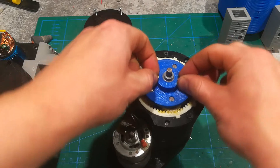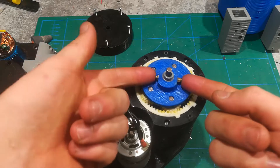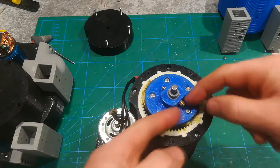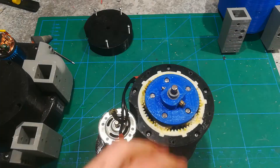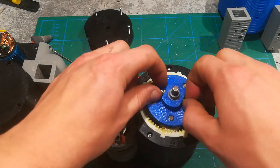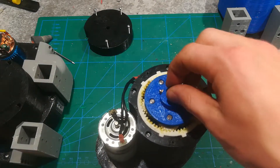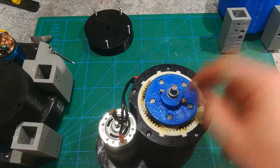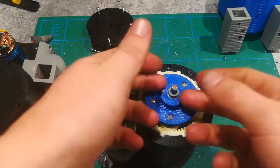At the end where I've got the output shaft mounted, I've got a nail right here — as you might remember from the transfer case video. I've also got these brass extended nut standoff things, drilled out to the same size as the nail, so the nail just goes right through and stays in there pretty tight. The reason you'd want to use a nail here is because this thing is outputting a lot of torque, and with a 3mm nail like this, you're not going to break it — something else is going to bust before this does.